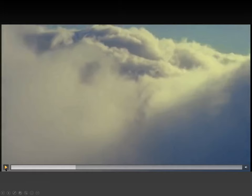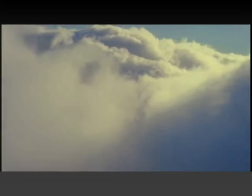All right, so this is the traditional rich of peak method, the only method available to us with a carbureted engine. And I just want to remind you that you only do this above at least 3,000 feet. You don't mess around with that at sea level and not at full power, because running at 20 degrees rich of peak at sea level with 100% power will eventually cause detonation, will drive the CHTs up, and is very bad. So you want to be at cruise altitude and cruise power before you start messing with that.